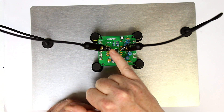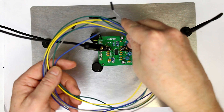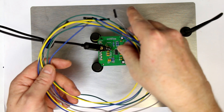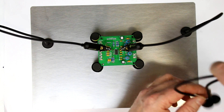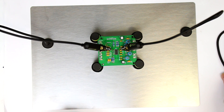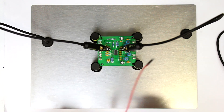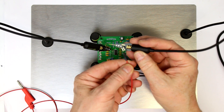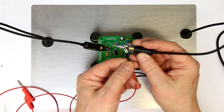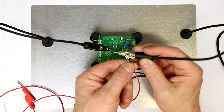What you still need is of course a connection from the probe tips to your multimeter or oscilloscope. Therefore you get a set of four — they call them DuPont to DuPont cables — which are especially useful for connecting the tips. All in all you get four tips. They are useful for connecting to, for example, a logic analyzer. And you get two additional ones with four millimeter banana plugs. At each probe tip you can attach two of the DuPont wires or connectors.